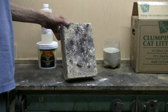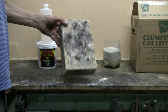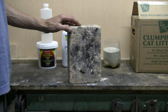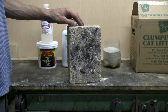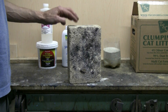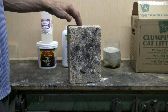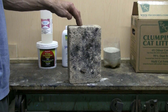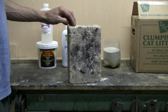The first option, if you can get them in your locality, is what's called a soft fire brick. These are fairly light in weight for their size and the advantage is they cut very easily with hand tools such as a hacksaw or even just a hacksaw blade. They can be joined together with stove and furnace cement, or you can make your own refractory cement with baby powder based on talc and sodium or potassium silicate solution to join the seams.